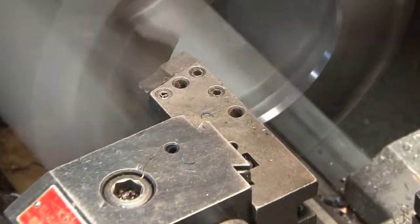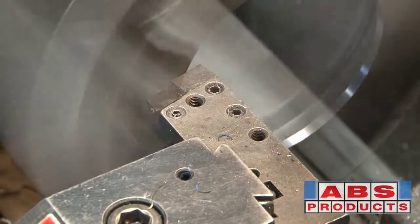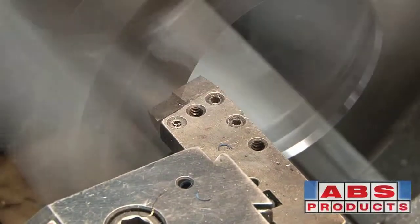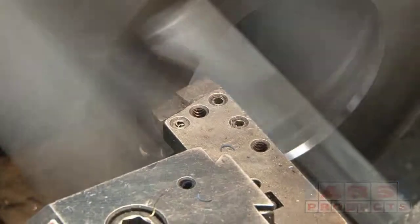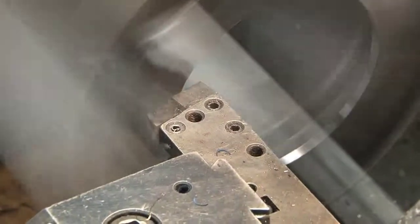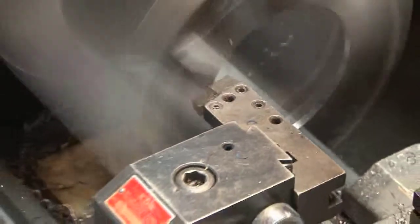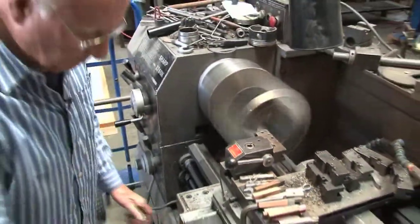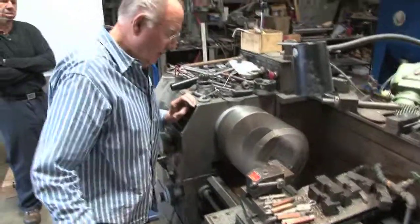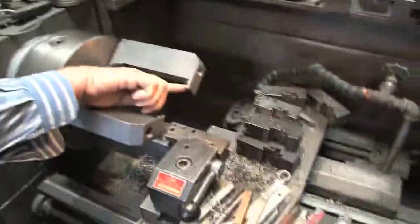That's just mainly a clean-up cut so it's a little bit better - I'm gonna square up with everything. I go in far enough for the depth of the ring and then I end up taking about 7, 8, 10 thousandths on a back cut, and that's what gives the beautiful finish on the back. Now you know as much as I do. But if you look in here on the back side, you can see what a beautiful cut you have - that back cut is what does that nice cut.